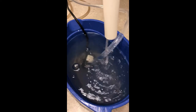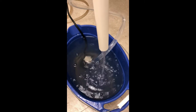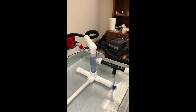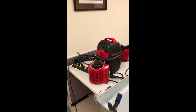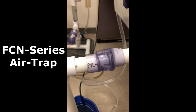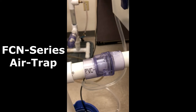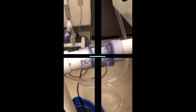This is the clear PVC reservoir — in this case it has five and a half inches of water in it because that's the five and a half inches of negative pressure being tested. When the water level gets up to five and a half inches, the ball moves away from the seat and the negative pressure trap lets the water run back out into the drain, and it's pumped back up to the reservoir — of course normally it would go out to the drain.